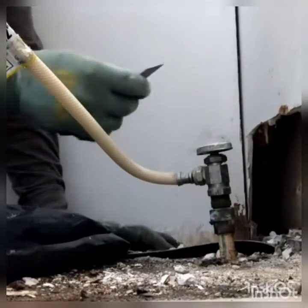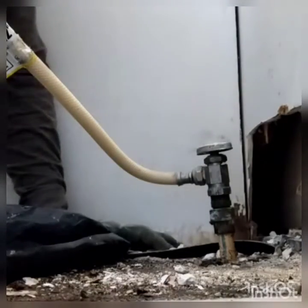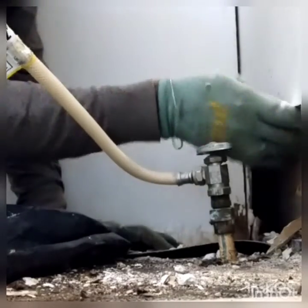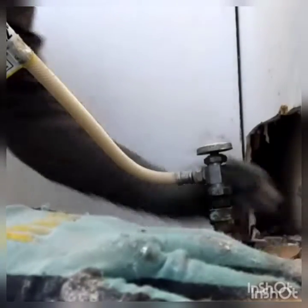What you do is take a razor blade and score it along the drywall, then you can punch it out, break it along a straight line and get it all pulled out of there. There's a little corrosion — the floor is saturated, it's soaked wet, I'm going to cut that out. The baseboard doesn't look too corroded, but it is, and this one here looks pretty corroded. I cut it off, and yes, I used the hole in the floor as a trash can. You've got to maximize what you've got.